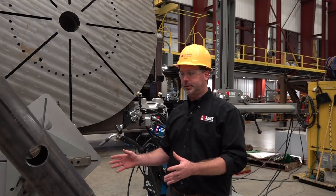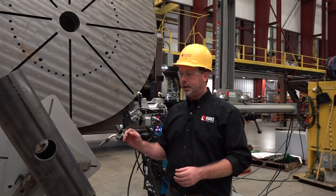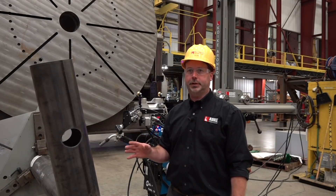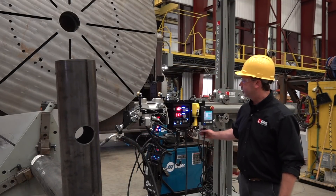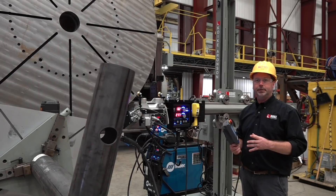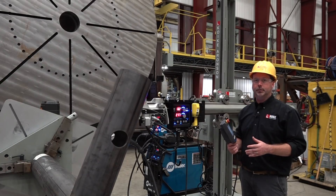How do you fix the speed problem on a rotator when you've got a big heavy part — say 10,000 pounds — that speeds up the rotator as it gets heavy on one side, making your weld look bad? Controlling weld speed for a procedure is always important. Our MD series has been fully tested at a fully eccentric load to maintain plus or minus five percent of set speed. We also have an optional digital speed control that lets you set your speed based on the diameter of your pipe, and the VFD controls that speed throughout the welding process.